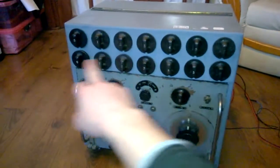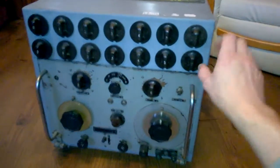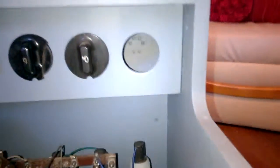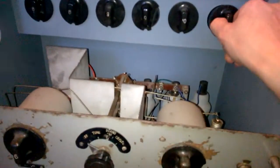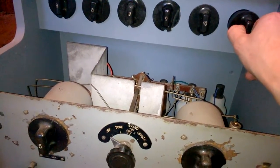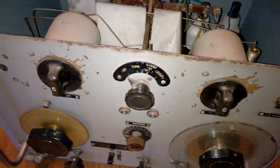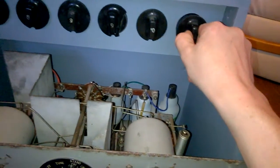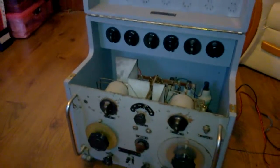There are seven pairs of coils — seven wavebands — these must be the more commonly used ones. Inside, if you flip up the front, there are another three pairs, which must be the less commonly used ones. It's all wooden construction with no RF shielding except perhaps on the main circuit board. It's nice the way it all flips open for servicing.